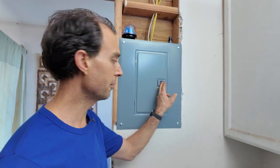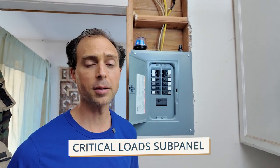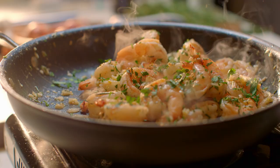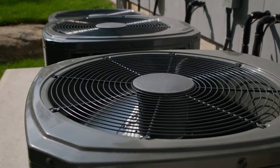This is why I highly recommend installing a critical load sub-panel, especially in homes that weren't designed from the ground up for efficiency. The critical load sub-panel lets you intentionally isolate what actually matters during a blackout — such as your fridge and freezer, lights, internet, a well pump, maybe a mini split. Not the entire electric range, 60-gallon electric water heater, dryer, HVAC system, and all that.